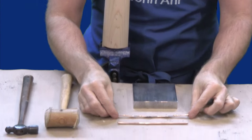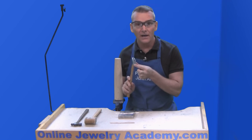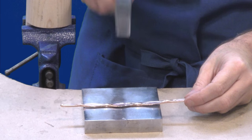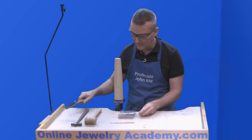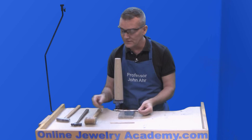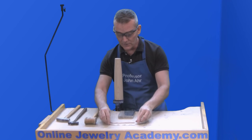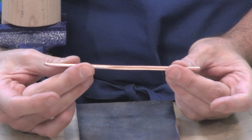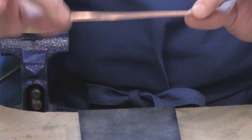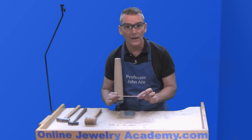I've prepped this piece already. What I did was I took the backside of a cross-peen hammer and just repeatedly hit in the same spot, stretching out in both directions a little bit in order to create this interesting pattern. You could substitute with a ball-peen hammer to create a different shape. You need to cut a piece of copper to the right length — for most people it's about six inches. This is a big piece of lightning rod, which is a heavy gauge of copper wire. Once you've annealed this wire, you're ready to begin. There's a video on how to anneal metal on our channel.